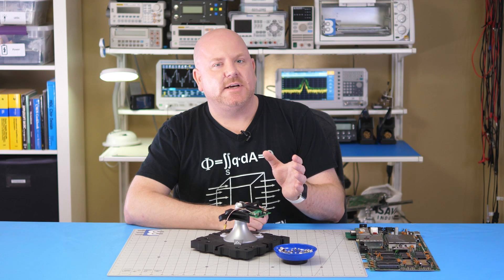Just like with my previous episode on polymer capacitors, if you'd like to ask questions, please head over to Element 14. There is a link in the description and we'll put one on screen right now. At that link I will also include a ton of scoped screenshots and details from the measurements that I showed — there are a few bits that I left out for time. In summary, the biggest challenge with using polymers in existing hardware is their physical form factors. From an electrical perspective, the impedance of a polymer will have an effect on your circuit, so you'll need to do some testing to see how well they work. However, it's been my experience that if they're designed in from the beginning, there will not be many issues. I hope you enjoyed the measurements and learned something about polymers along the way. Thank you for watching — if you have questions, please come find me on the Element 14 Community.